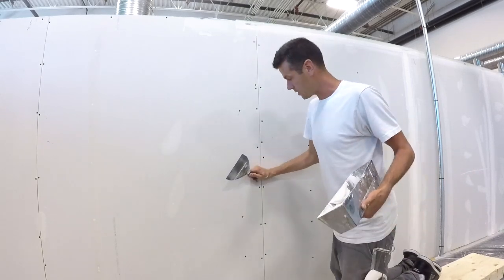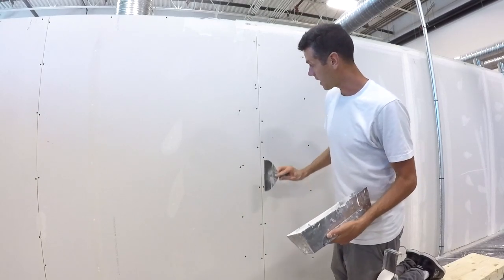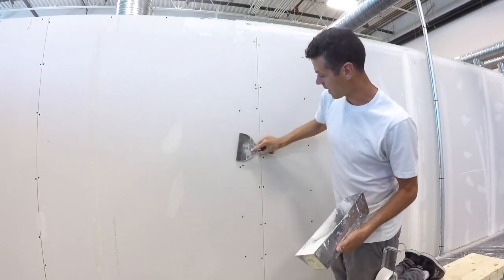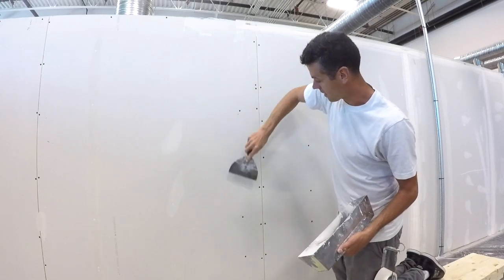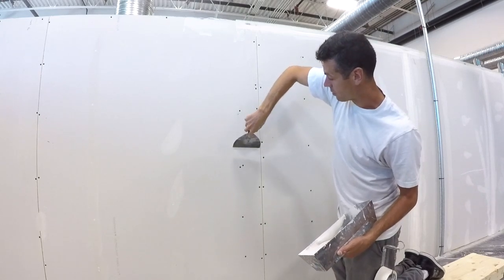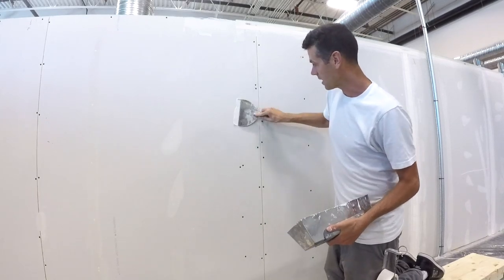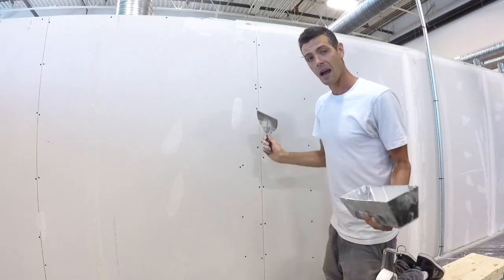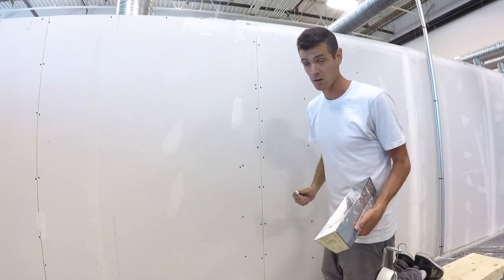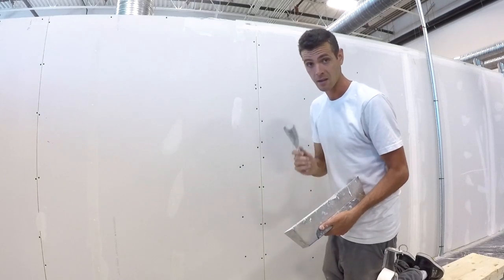So also what we need to get into is how much am I putting on and how much am I taking off. It's just a thin enough layer to cover them all. I'm changing the angle of my knife — when I put it on my knife is really flat, and then when I take it off it's at least a 45 degree if not more. It's quite steep, and that way it takes all of the mud off. Because what you don't want to be doing is lumping it on here and then having a bunch to sand after. That's a pain. There are a lot of screws in a typical drywall job — if you're having to push your sander across it more than once or twice that is a real pain in the neck.